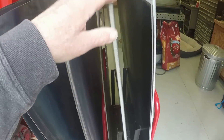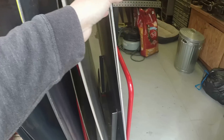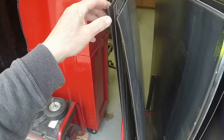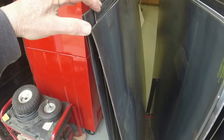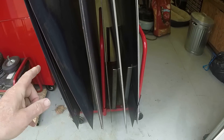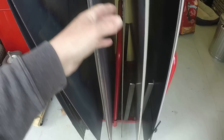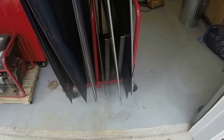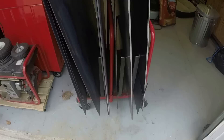Based on what I have in here: two pieces of 3/8, two pieces of 1/4, a piece of 3/16, several pieces of 1/8, and several pieces of 16 gauge. There's also what looks like 1/32 inch — actually three pieces of it. Anyway, I've added all this up and it comes to a thousand fifty pounds, not counting this half sheet of 3/16, so eleven hundred pounds plus the rack — maybe another fifty pounds — so eleven to twelve hundred pounds total weight.